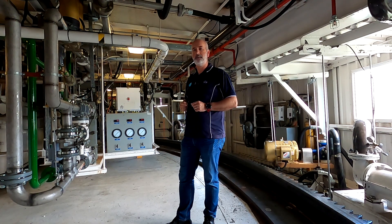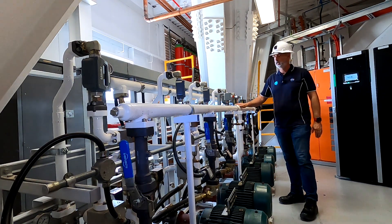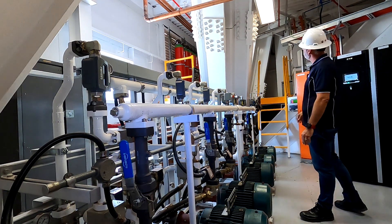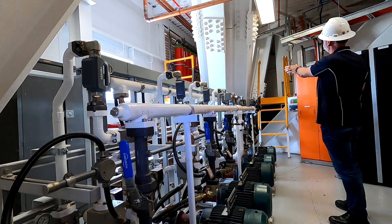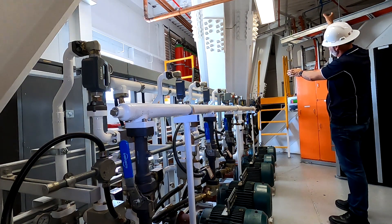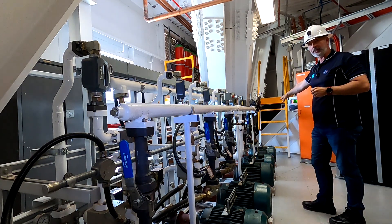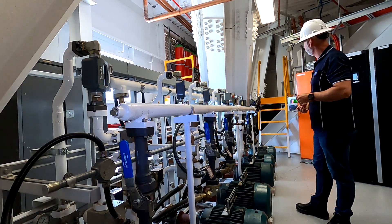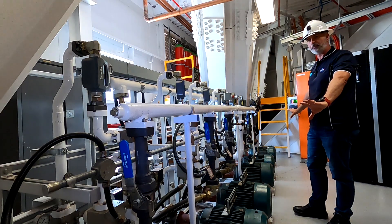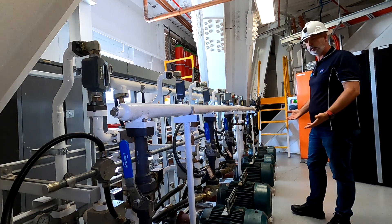Let's have a look at the skid pumps. These are the pumps, or skid pumps, for pad number one. Looking at the structure, you've got the beam coming down here, and you've also got the beam coming down from the elevation bearing. Underneath the floor they will meet, and underneath that we have pad number one. These six pumps, or skid pumps, provide the pressure for each of the recesses within the pad, creating lift. We have a maximum pressure of 2,500 psi.